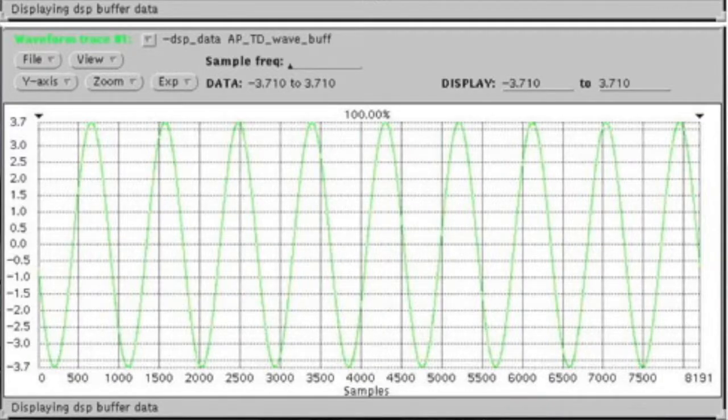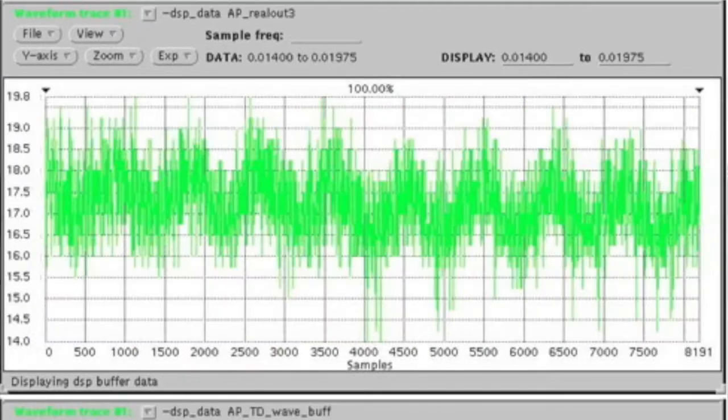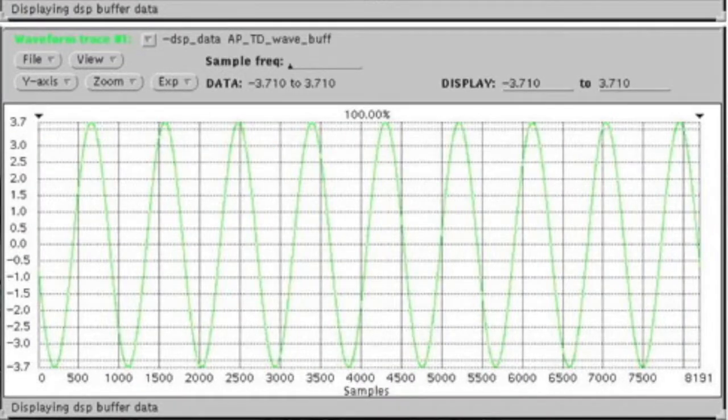The advantage of doing an FFT, in case you didn't know this, is that the noise is spread out among all the bins, where originally they were taking the average and then looking for the RMS. There's no noise rejection there, no noise rejection at all. But when I do the FFT, then the noise is rejected a lot. So now the signal is in one bin, and I forget what bin that was, but here it is. Here's the signal, and you can see that their signal looks like shit. My signal, on the other hand, it's beautiful.